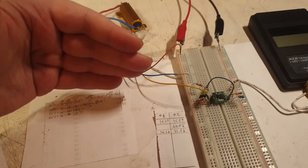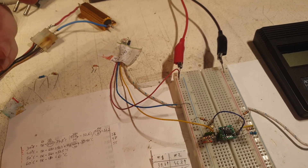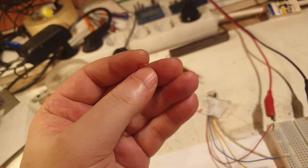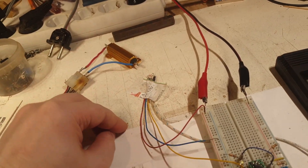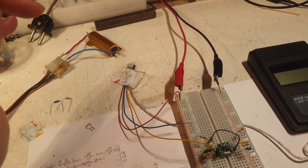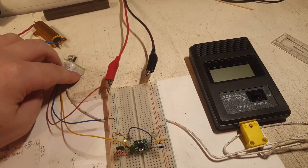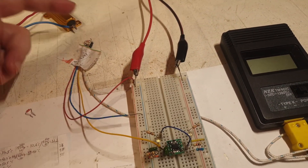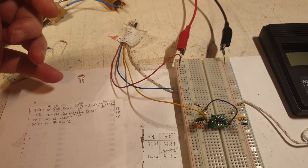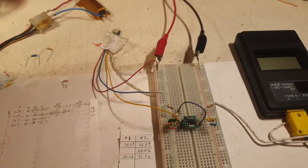I tried to peel off the glass to get closer to the sensor element but it didn't really help. The unmodified one had eight to ten degrees of difference. The modified one is a bit more sensitive but still not as specific or accurate as I wished — not as precise as the bare metal thermometer probe. The NTC thermistor in this configuration is an imprecise sensor, but it can still give you a rough hint of the temperature reached.